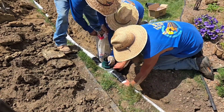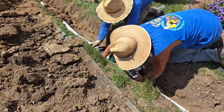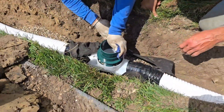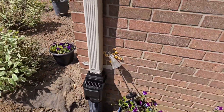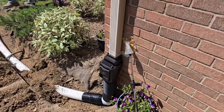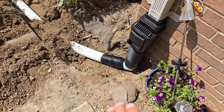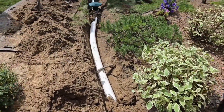This line ended up deeper — you can see the guys have two risers, which means four inches of lift since the risers are two inches each and stack on each other. Slip fit, no glue right here. Look at this — a leaf filter, vented clean-out, gutter adapter combination: an absolute must for any underground barrier downspout system. It's on a dual-wall riser with a not-quite-a-90 that puts it on automatic slope, one piece all the way to the catch basin.